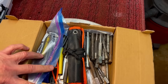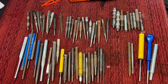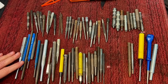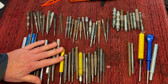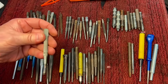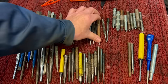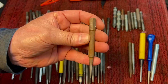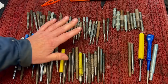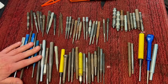Let's take a look and see what we can do with these. Like screwdrivers, there are so many different types of punches, each with specific uses. We'll go over that in a minute, and how to dress your punch and check it to make sure you won't have any issues. First, we've got to clean them up. Because of the knurling and storage, they tend to get a little rusty. The wire brush does a fantastic job — that's really all you need. Wire brush, wipe them down with some light oil, then store them.